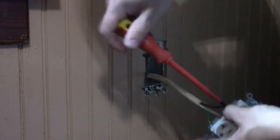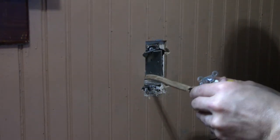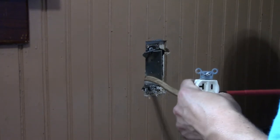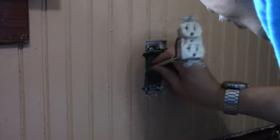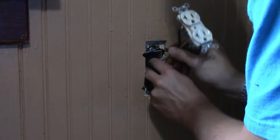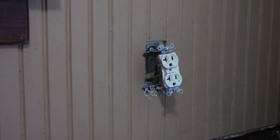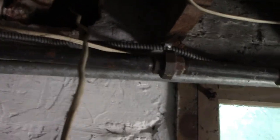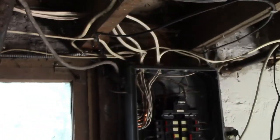Because I'm going to check before I put this back into the box, I'll know, and I won't have to pull anything back apart. So I'm going to feed the wire back down partway — I don't want too much sitting in the box to deal with. Alright, that's probably close enough. Let's go downstairs and wire it up to the main circuit. There's the wire running down — I'll vacuum through that one spot and a little bit on the box here just to avoid the spider webs. I pulled the wire up, so I'll pull it down a little bit, run it back along to the box, drop it in.